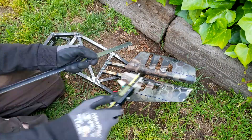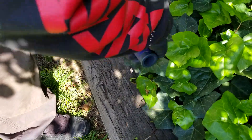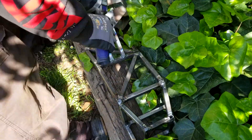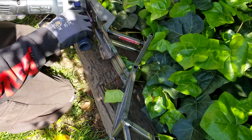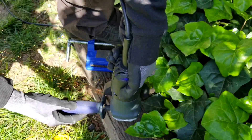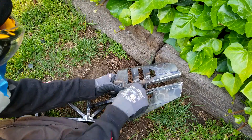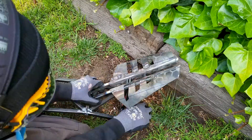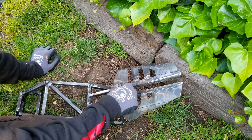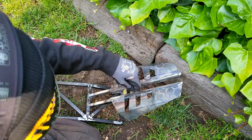I was trying to stress the seat that I had just welded on in the last episode and trying to get it to flex or move, and the only way it barely moved was in between the two parts. It's more than strong enough, but I did think I could add some details that would make it look a little bit cooler and also help stiffen it up. I could have made this easier on myself, but because I wanted a certain aesthetic I wanted things to look more like a vent or aerodynamic — some sort of visual difference that isn't just a plain bar. This was a bit trickier than I had originally anticipated because I have quite a few elements that need to be lined up particularly, and the two planes diverge at the end so it's kind of a space that gets wider and wider the further it goes out.